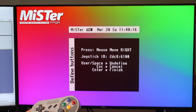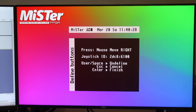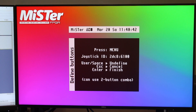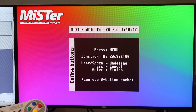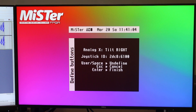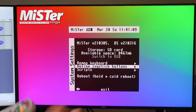Select, start. If there's any button you don't want to use, you could just hit undefined by hitting space. There's a user button on the IO board you could also use, but I'll use the space bar since I have the keyboard out. Now you can make a menu button here — I actually have extra buttons on this controller so I can make a separate menu button. Or if you want to use a joystick combination for two buttons, you could do it that way too. Then hit OK — we'll make B OK and A back. Tilt the analog right, tilt Y down, and that's it. It's mapped. Now you can see I can actually use the menu here with the gamepad.